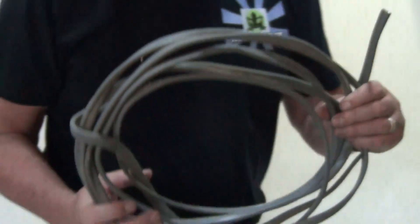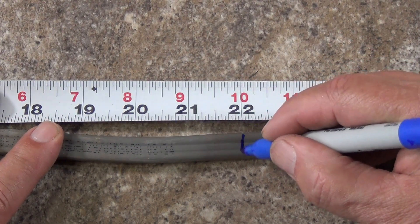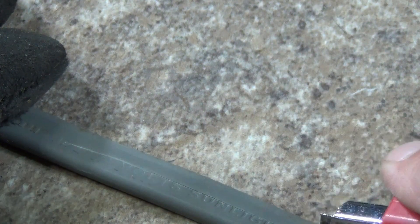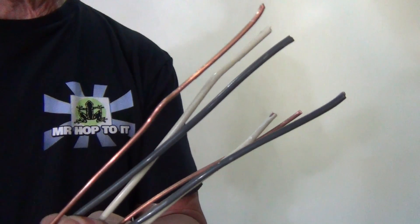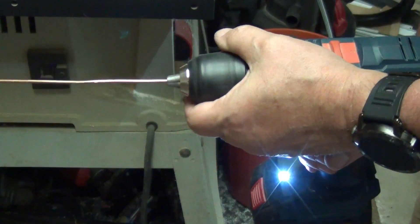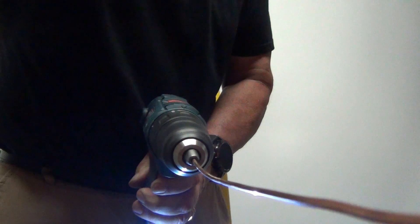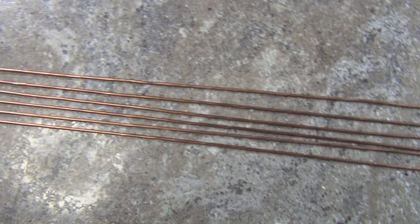I'll start by making the elements. I'll be making four matching hoops and the wire connections for the antenna out of this. I measure and cut two lengths of cable at 22 inches each. I carefully slice off the outer sheathing and remove the inner 10-gauge wires. Each cable has three wires, so I get a total of six. Using the utility knife, I slice away the wire's insulation. The wires are not very straight, and I need them straight to form the hoops. The easiest way to straighten them is to lock one end in a vise, and using a hand drill and a bit of back pressure, slowly twist the wire. It doesn't take much twisting before the wire is nice and straight.